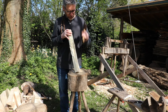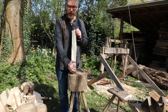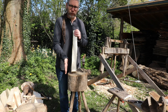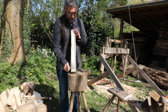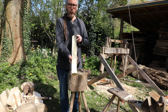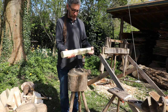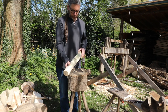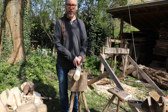Also watch out for how straight the piece of wood is — whether the grain runs straight the way down. If it starts curving off, then you have to start correcting that curve with the axe if you're going to be turning this with a nice straight billet. But that's roughly all I need to do with this — I could then go on to the shaving horse and do some draw knifing. So that's an initial look at axe work. I hope you've enjoyed that and I'll see you next time out in the garden.